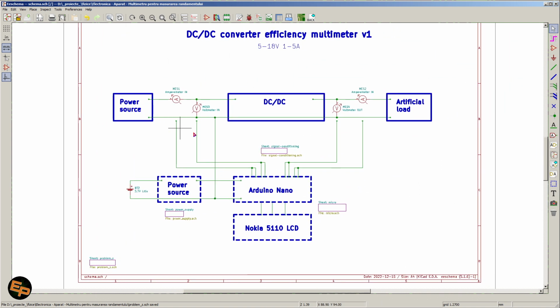This is a first problem because when we have 4 multimeters on the workbench, they occupy a lot of space. They also have various cables, and those cables occupy even more space and bother us on the workbench. Those cables also typically don't have a negligible resistance, sadly. They have a resistance that will start to matter at higher currents because they will develop quite a bit of millivolts of voltage drop, potentially even hundreds of millivolts, which is going to be significant. So yeah, those are a first set of problems that we would have. Of course, the method is working. We can use this method, but it's not elegant.